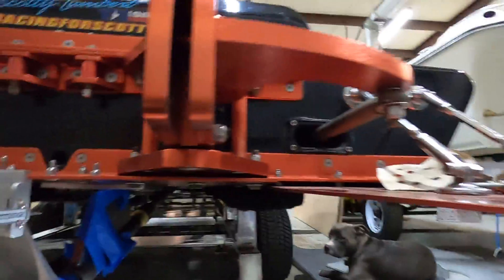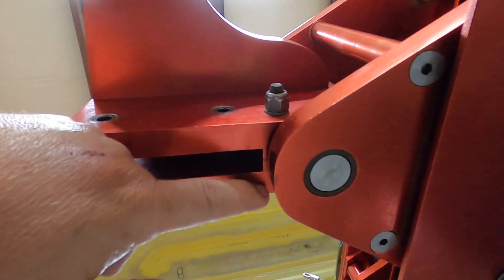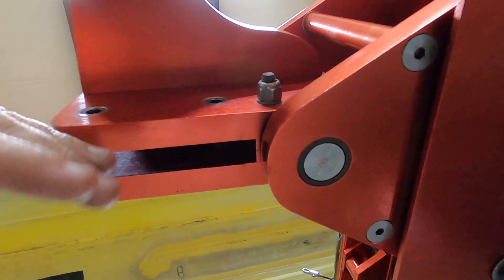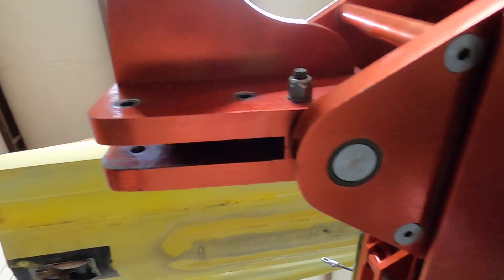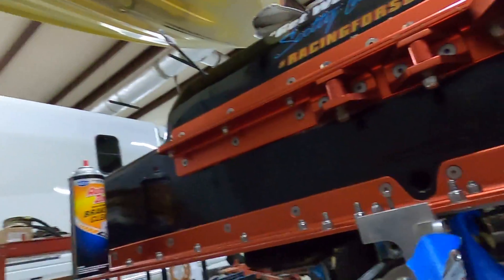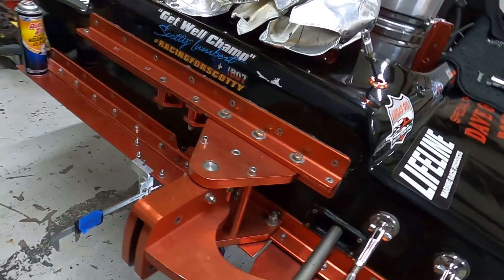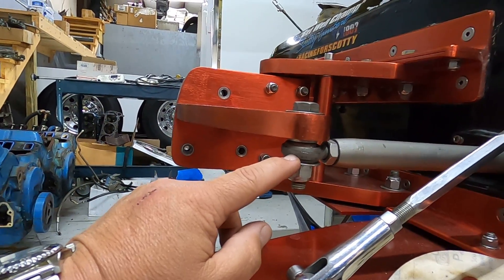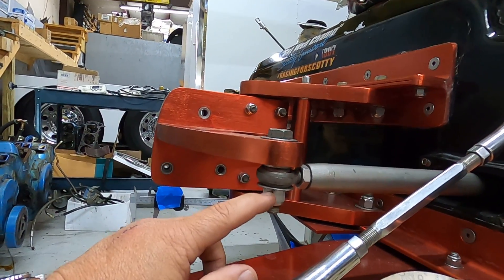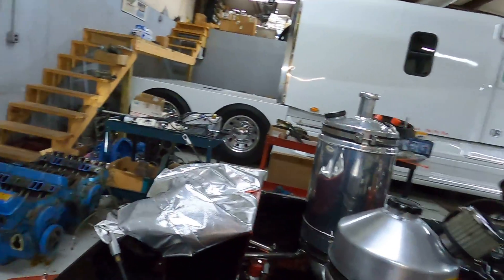Another thing to look for is this part where it can rip out of your clamshell — the rudder slides up in here with a lot of torque on it, and I've seen these start cracking through here, so that's something else to monitor. I also don't have any light hardware on the back of this boat, trying to keep it beefy. Make sure the washer here is bigger than your heim joint so you're not pulling the guts out of it, and make sure none of your heim joints are aluminum.